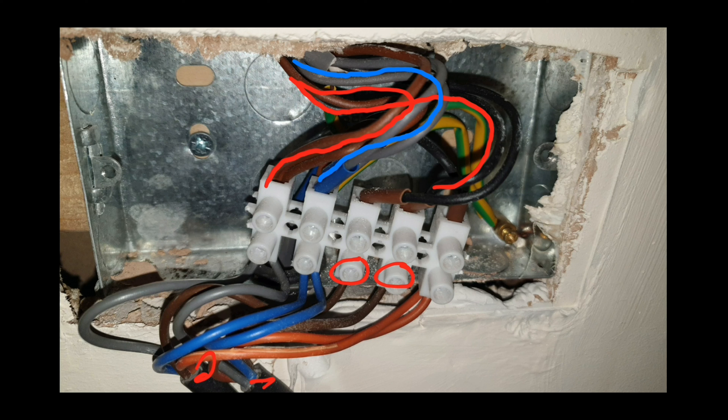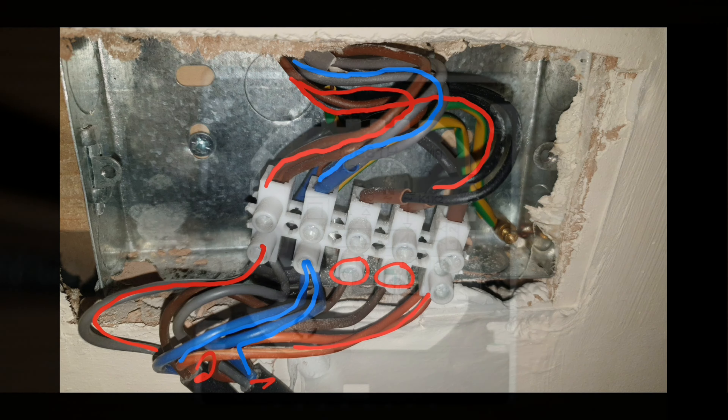From the motor itself, there is another wire coming up — the neutral wire — because the motor must have a neutral, as it's not battery powered. And then it will also have a live, which we can see over here going to the live terminal. You also have this switch live, which basically tells the boiler to turn on. From this, I can deduce that it is a neutral wire.